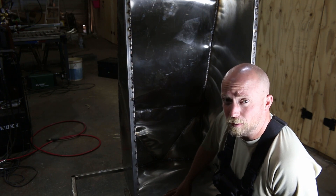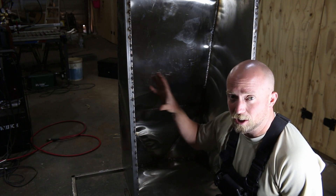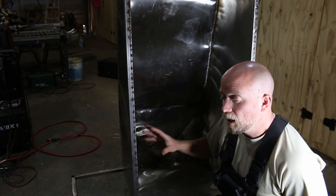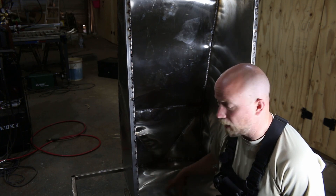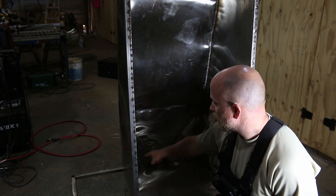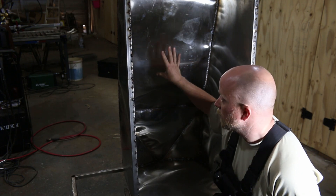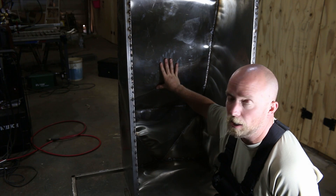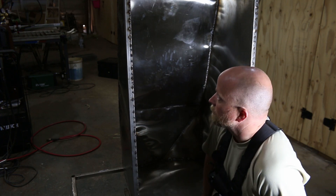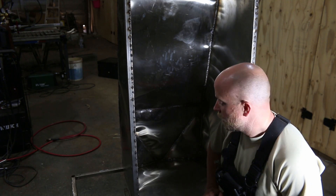We're going to build four of these towers. I need to build three of these fish tanks — you'll see all this come together on the channel, so stay tuned. We're going to build them out of stainless just so we can prove that they work. Once they're proven and we get all of our design issues learned from these prototypes, we'll update the design and send that off to get tooled up as part of our fundraising. What I'm hopeful for today is that I can get all these holes tacked up, which I have marked with marker. You will notice warping — I don't care. This is a prototype to prove that the system works. There's really no way I could have stopped it. I used aluminum backers. At this point, what we need to do is get water in this thing, finish welding it, and then start building the next sections of deck. So let's get started.